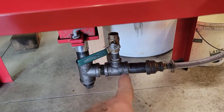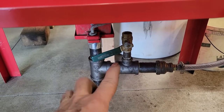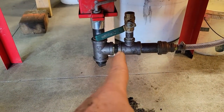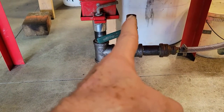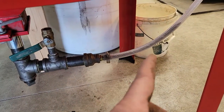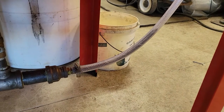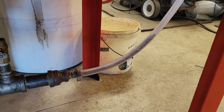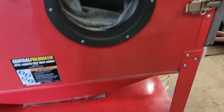I shortened that pipe up. Actually that pipe was over here, so I just took and turned the whole thing around and made it as short as possible so that the sand will come down. This is the air that mixes with it and then it shoots it out the hose. You can see the media up the hose there a bit, but that is just about as high as I can get it. It'll pull up sometimes and sometimes it'll want to surge a little bit. I adjust that air pressure.